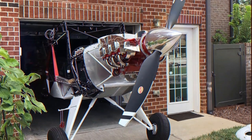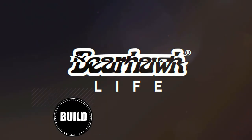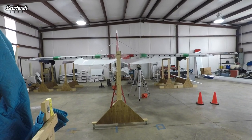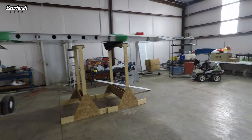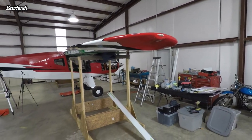That pinning to the fuselage is going to allow me to hinge the wing up one degree on each side and get that dihedral set. As we stand behind the airplane you can see we're down one or two degrees on the dihedral, because we're only hinged in place at the fuselage and resting on the outboard side of both wings. You can also see the Horner tip — it's in place and looks really nice at the end of that wing, but that's not what we're working on today.